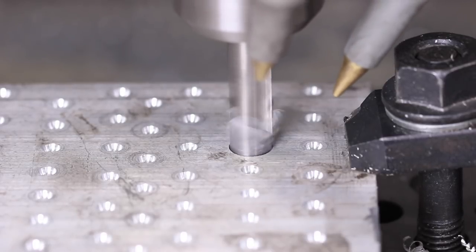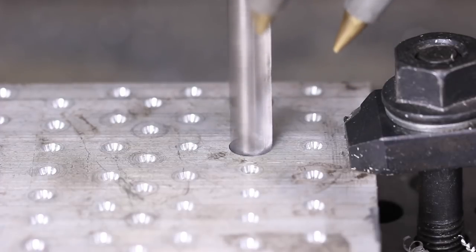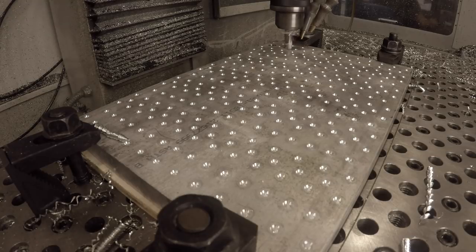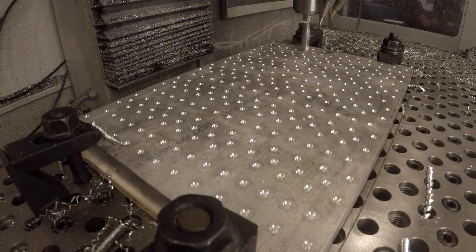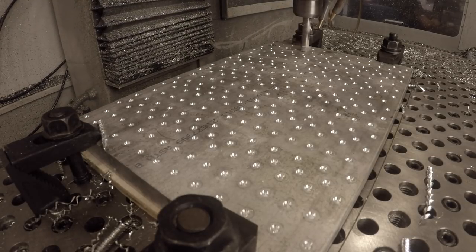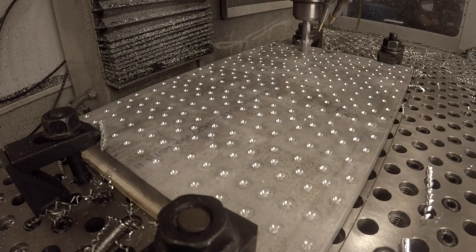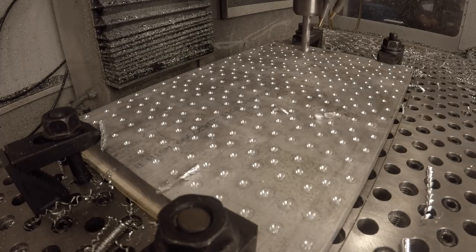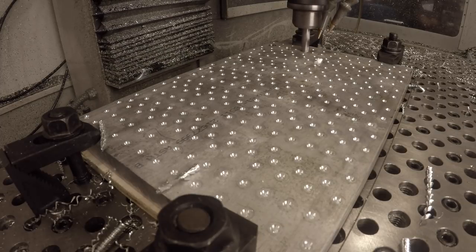And as I've talked about before, we're doing that short pecking. So we're pecking, I think, every 90 thou. But then in HSMWorks, what we can do is have a full retract every, say, 0.3 inches. So it's not gonna do a little mini peck the whole width of the hole. It's gonna give it two or three breaks to really do a full retract. Make sure you're not bird nesting and get the chips out of there.